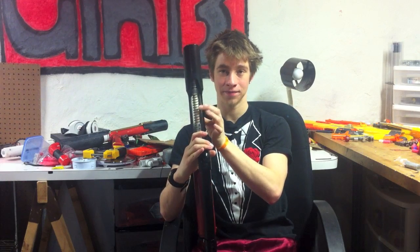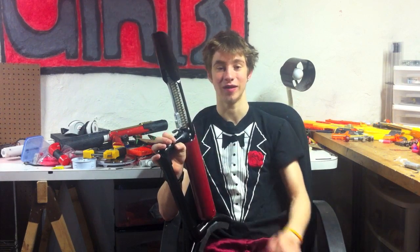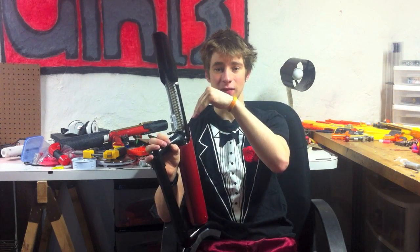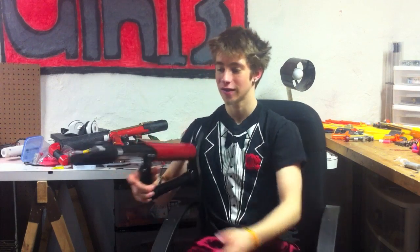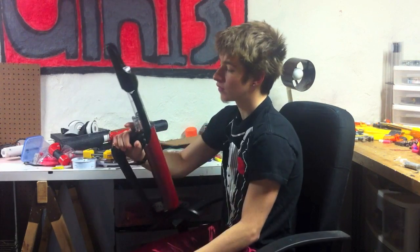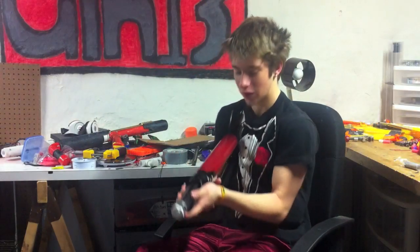It's a polycarbonate tube that's see-through, and the reason I wanted this was not only for aesthetics, but also to check my seal. Because my seals on these are normally perfect, but sometimes the skirt that I'm using will fold and really shoot the seal to pieces, and I want to be able to see when that's happening. Right now my seal is folded, because I have a plunger skirt that's slightly too big for it — I need to get a shorter skirt.